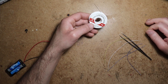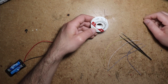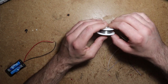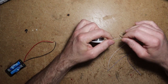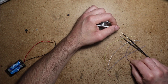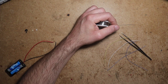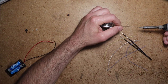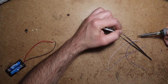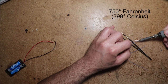I use a common, well, this isn't all that common. It's silver bearing, but any kind of small diameter rosin core solder, 60-40, anything that's safe for electronics. Rosin core is good to have. You don't have to mess with flux hardly ever, and it's very clean and very fast. So, when soldering these, I've got my tip temperature almost universally set to 750 degrees, and that sounds high to some of you,